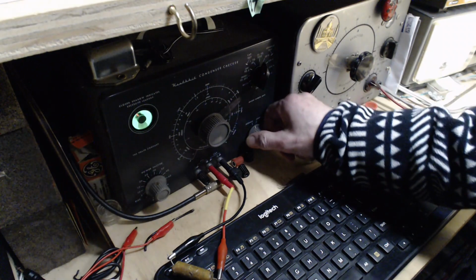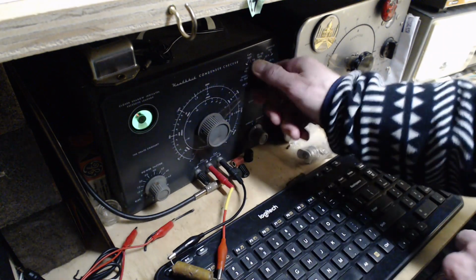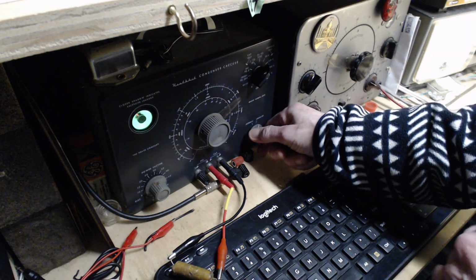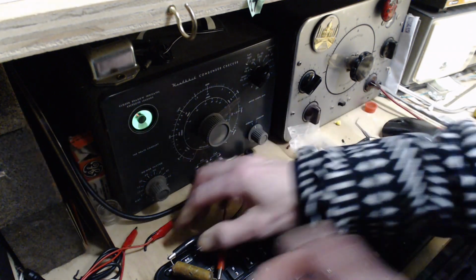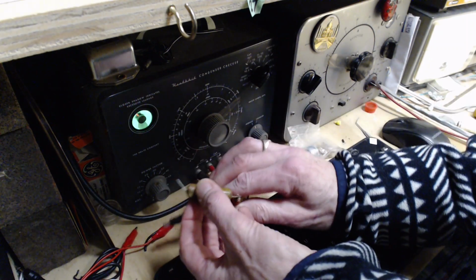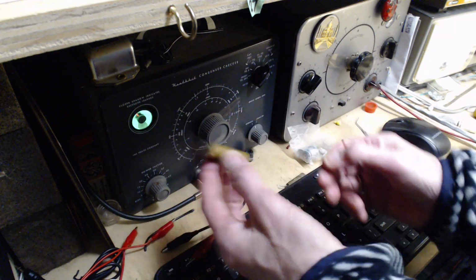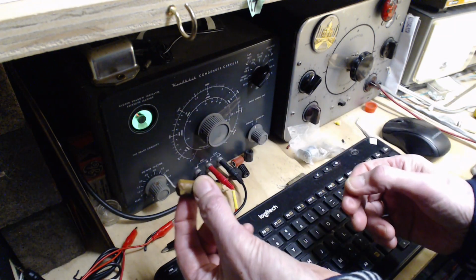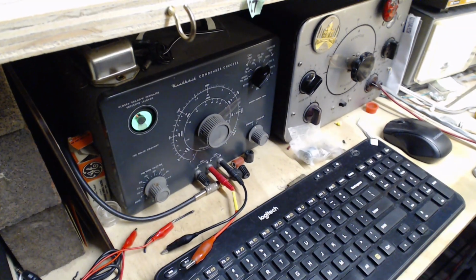Okay, 50 volts on this guy. He's opened up halfway. 150, I doubt it'll open at all. So a little bit of a worse state, but also this guy's just going to the chassis. Now, is that leak as indicated by this device sufficient to declare this to be a dangerous situation? Jeepers, I don't know. I don't know.